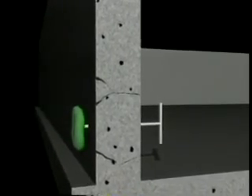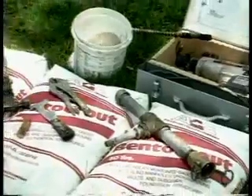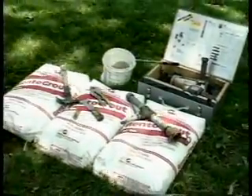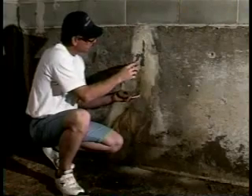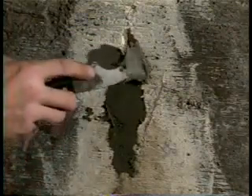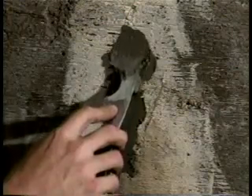If access is not available from grade level, tunnels, vaults, manholes, and subgrade structures should be injected from the interior. Additional tools required for internal injection will be a drill, grout packers, heavy-duty grout hoses with quick disconnect fittings, and 3/4-inch outside diameter insertion pipe measuring 12 inches in length. All cracks in brick and concrete should be addressed before using Bentogrout. Large cracks or voids should be injected with Setco's AquaSeal or patched with hydraulic cement. This will prevent Bentogrout from migrating back into the structure.